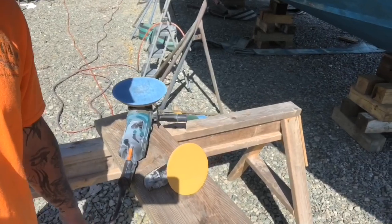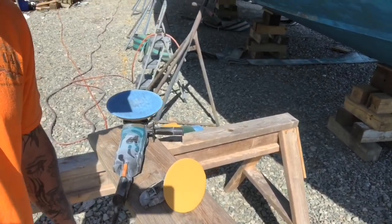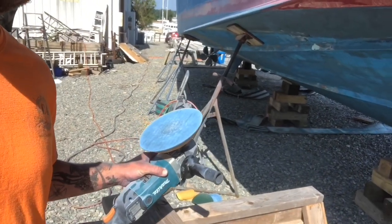Here I am steadily removing clear coat. I was using this little six-inch sander and it was working, but it's not going fast enough for my liking. So I've pulled out the big guy. This thing will work you out. If you're not familiar with the eight-inch grinder setups, they are dangerous and you have to be very careful, because they will create so much damage on a boat that it's unbelievable. So if you're not familiar with using an eight-inch setup, I would not use one.